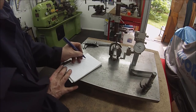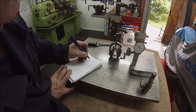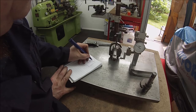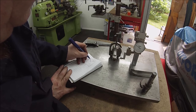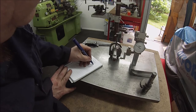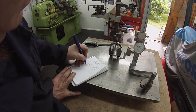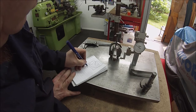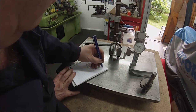Now if I do a very rough sketch of my V block, put him in there. And there's my inner shaft and my dotted flat there. Then the pawl is going round there to there. Yes, I was always brilliant at drawing. Something along those lines, and that distance there we are saying is 0.1565 to there, and that height, we'll get a measure of that.